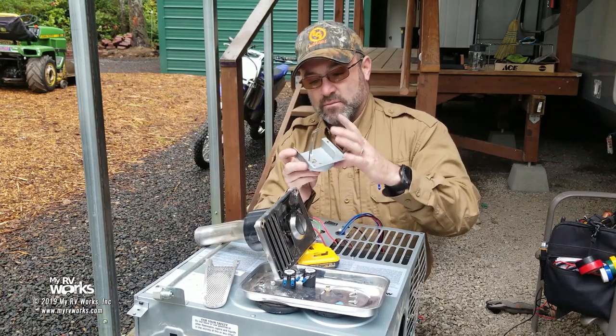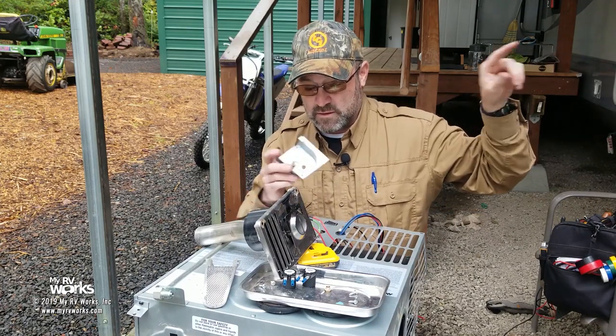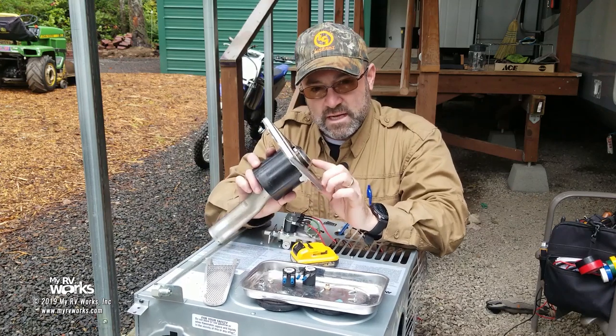If you do have LP at this point, then the problem is you're not getting ignition, which could be a problem with the igniter here, which might lead to the board. I've got another video specifically on that. Go watch the playlist. But on this one, we did not smell LP.